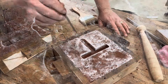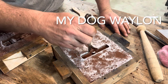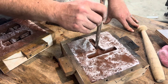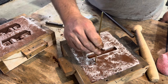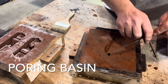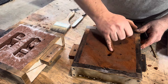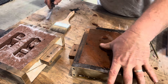Here I'm just rounding off those sharp 90-degree corners. Anywhere there's a 90-degree angle, as the molten metal goes through it can actually form air bubbles. You want everything as smooth as possible when you pour it. Here I'm cutting the sprue and then adding vent holes. The vent holes allow gases to escape as the molten metal is going in. Now I'm putting in the pouring basin, and then touching it up with my fingers to make sure there are no sharp points. Having everything smooth prevents air bubbles from getting into your casting.